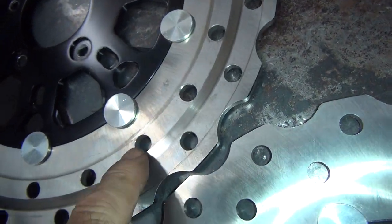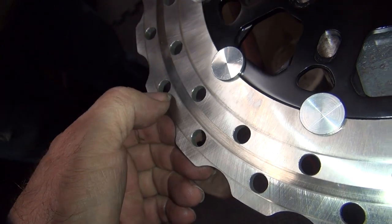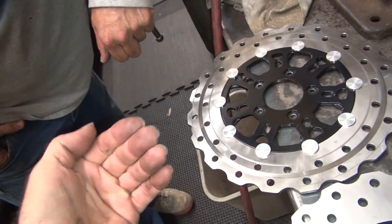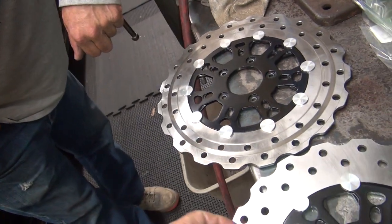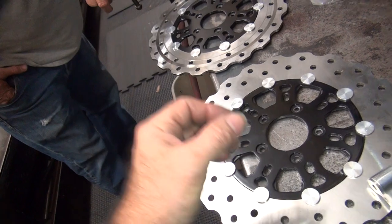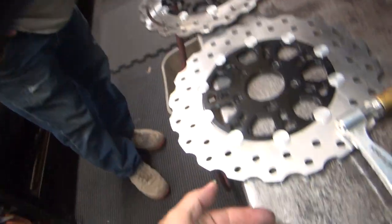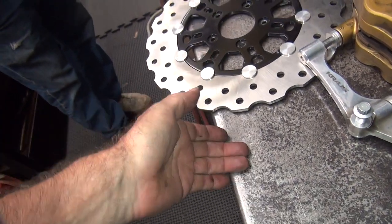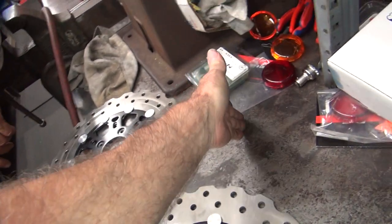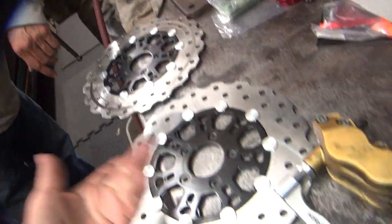This is the deburred side — see the chamfer marks in there? I could shave with those ones almost. But when you push down with the cutter, pressure raises the edge up. The cutter wasn't cutting, so it was pushing — rubbing the metal off instead of cutting. So it kicked up a little edge because the pressure you're pushing so hard on it. It's like when you take a pick and go across the ground — it'll cut the groove but also puts up a little edge on the side.